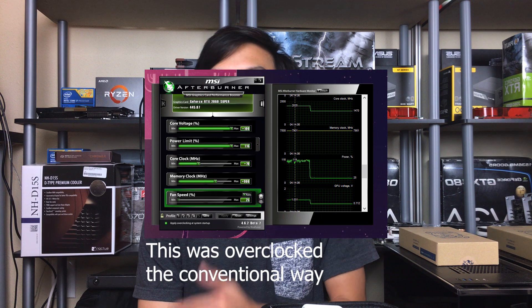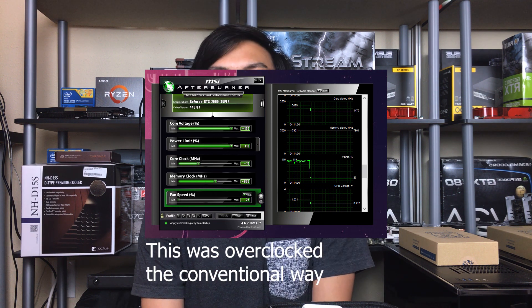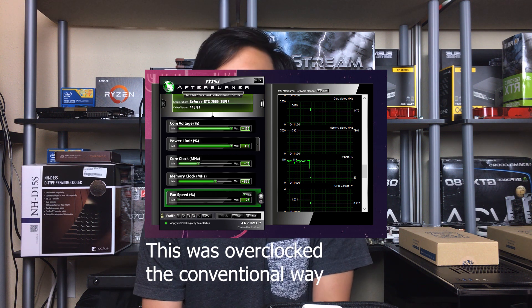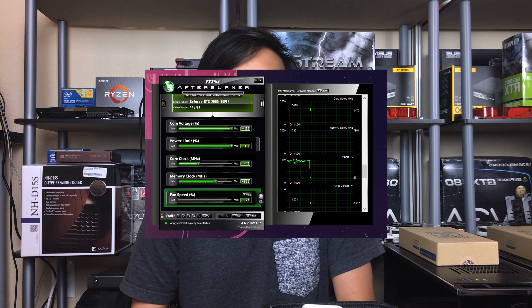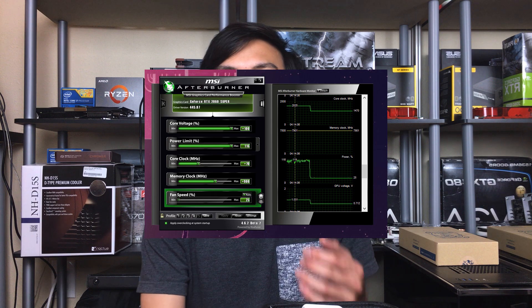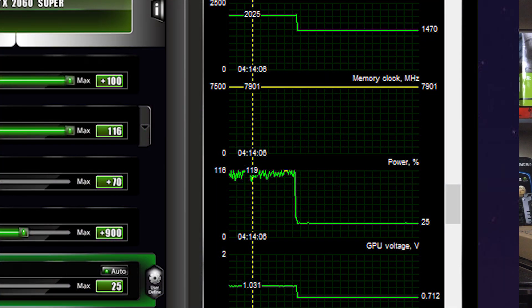If you increase the power limit while overclocking, the BIOS allows you to go all the way to a 245-watt TDP, which is quite high for a 2060 Super. Only very few cards have a higher power limit — like the ASUS Strix or the Gigabyte Gaming OC in the 260-something-watt range. But when overclocking, even 245W isn't quite enough, as I figured out — it'll still hit the power limit. That's why I had to take apart the card and do some shunt mods to get it where I want overclocking-wise.